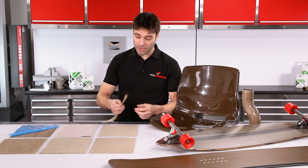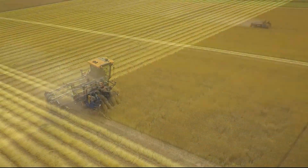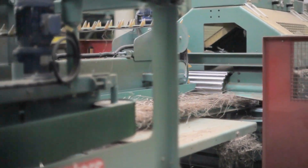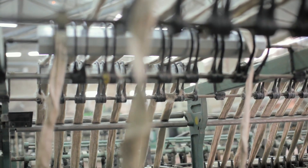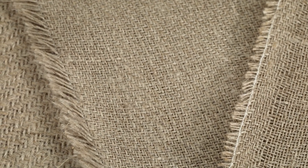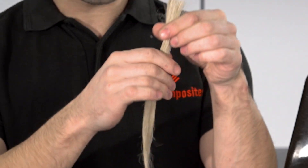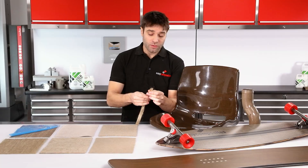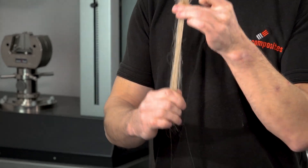So what is flax fibre? Flax fibre comes from the stem of the flax or linseed plant, grown and harvested specifically for this fibre. After harvesting, the plant is threshed to remove the leaves and seeds before being soaked and dried, breaking down the binders that hold the stem together. It's then processed through rollers and combs to separate and straighten the long fine inner fibres before being spun ready for weaving. There's nothing new about woven flax fabrics — they've been produced for thousands of years — but what makes them particularly good for composites is the long continuous cellulose fibres, which for a natural fibre offer excellent tensile strength and stiffness. Other natural fibres like jute and hemp can be used, but flax is the most common as it generally offers the best mechanical performance.